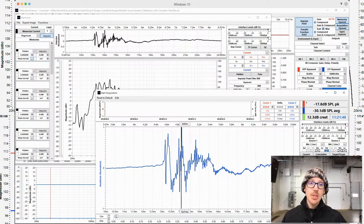And so as soon as I turn on this noise reduction, it's going to diminish a lot of the sound that is not right where this delay locator is. And ultimately that's a bad thing, right? Because we are getting rid of direct sound and we're keeping the reflection. And now we're going to do our alignment to the reflection. So let me show you what I mean.